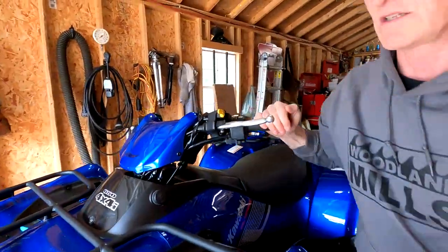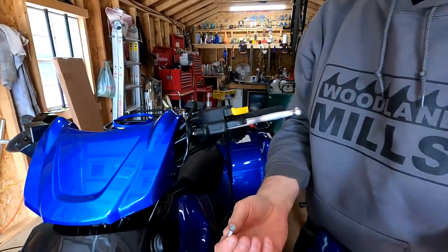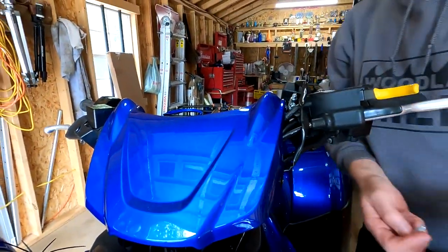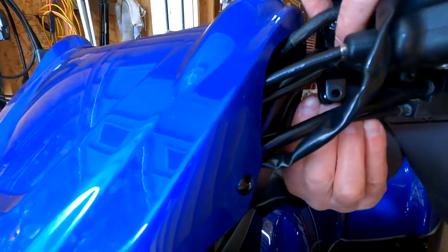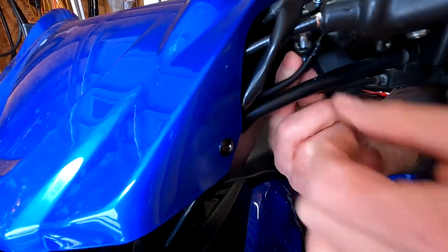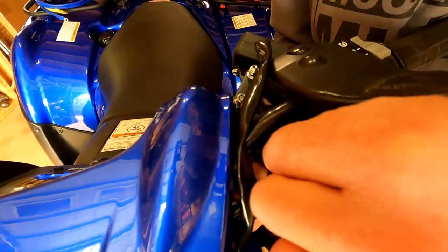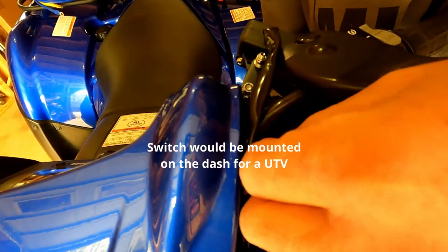The wire is through and I've got it started on the other side. Now I'm going to tighten up the mount — it's an Allen bolt with a lock nut, lock washer, and a flat washer. I'm going to put it in from the other side, put the washer and nut down for now until I get the bolt through. There's the bolt, and then I'll put the flat washer first.